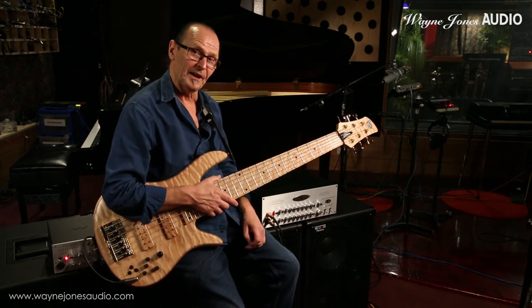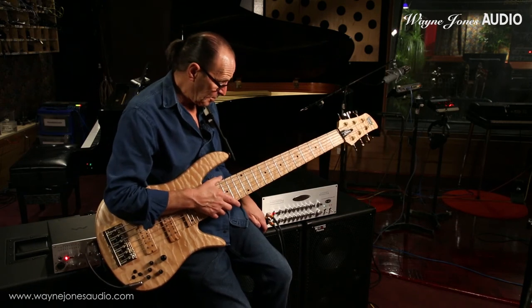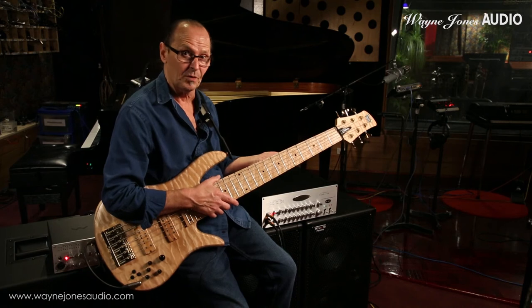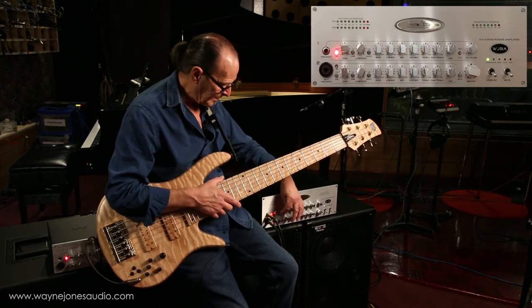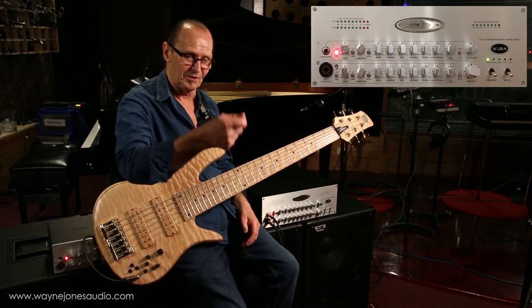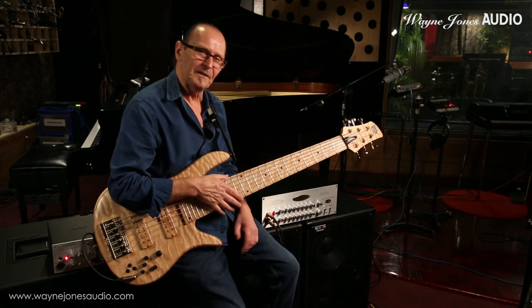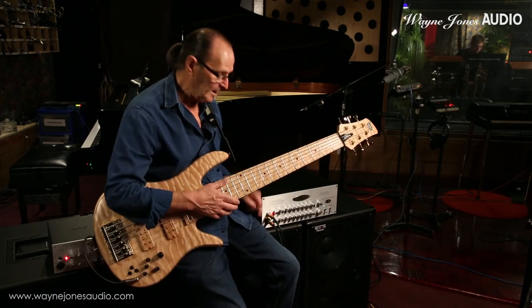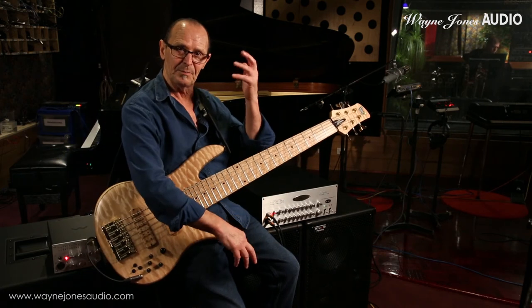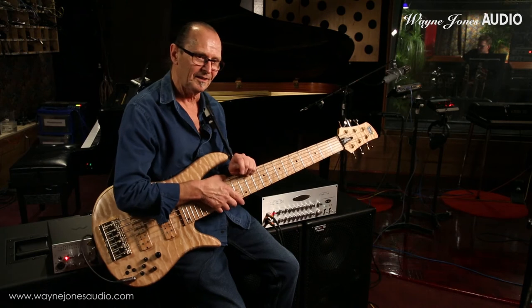So in a twin channel preamp, this one is phantom powered. You can use it as two normal basses if you want, but for Scott, it's got a phantom power switch, and the switch is like an American light switch. On is up, so don't confuse. So that will send a phantom power source to his mic on his upright, and then he blends his bridge pickup on the upright with these two until he gets a nice blend of both, and he's a happy boy.